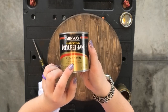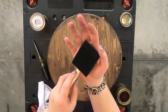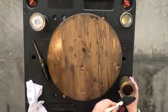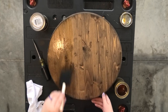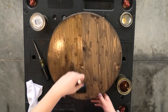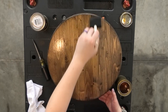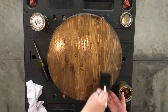When it's time to polyurethane, I really like the Minwax Polyurethane in Clear Satin — I prefer the least glossy polyurethane possible. I also prefer to use foam brushes when doing my coats of polyurethane so you don't have to worry about any brush bristles falling out in your coat. You dip the foam brush into the polyurethane — you don't want it to be oversaturated, so wipe the excess off on the side of the can — and wipe the polyurethane on in the direction of the wood grain. You're going to see a fair number of bubbles in this coat and that's okay. Don't spend a bunch of time going over the polyurethane trying to fix the bubbles because that oftentimes just makes it worse.